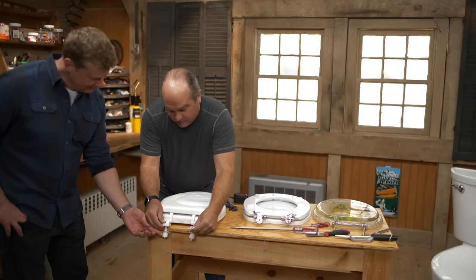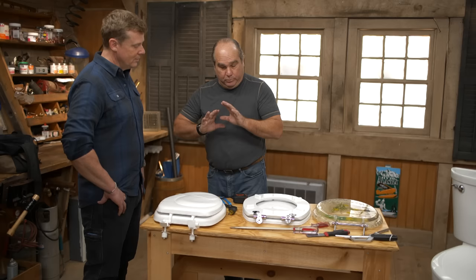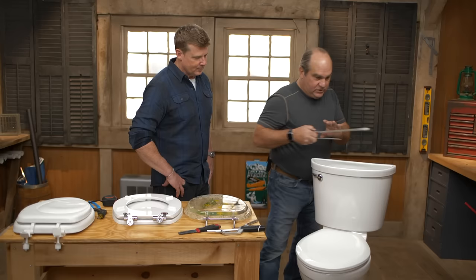The connections couldn't be simpler nowadays. All the parts are plastic, so you're going to see bolt covers like this — you lift them up, and then there's a gasket right here, there's a nut underneath, and you tighten them up, snug it up, and you're done. It's been a while since I've seen anything but plastic, but there have been other materials in the past. Putting a new toilet seat on is almost always simple — it's almost a complete do-it-yourself project nowadays.